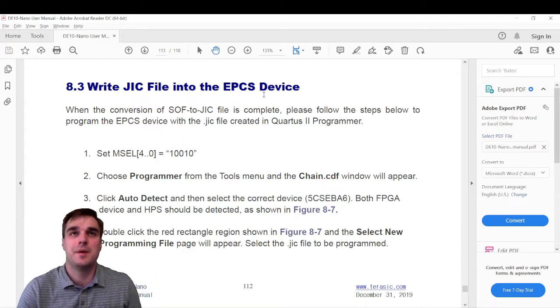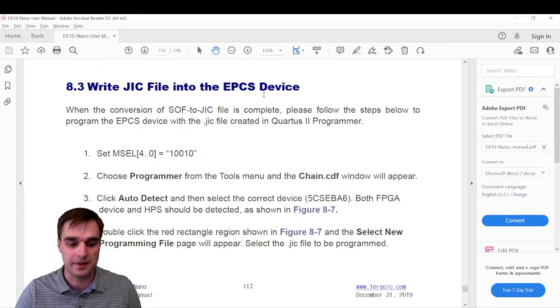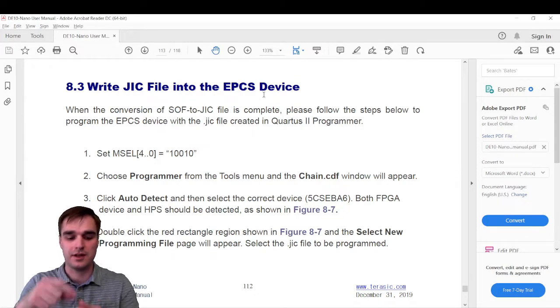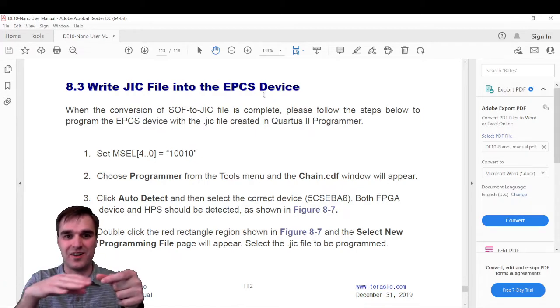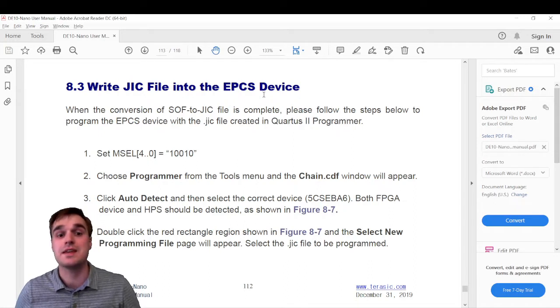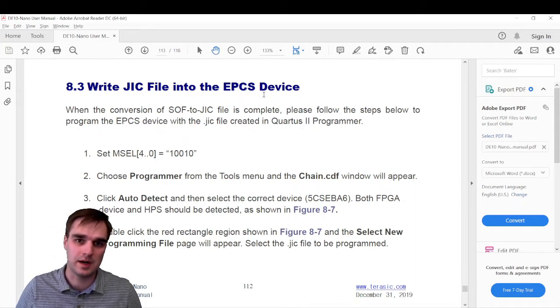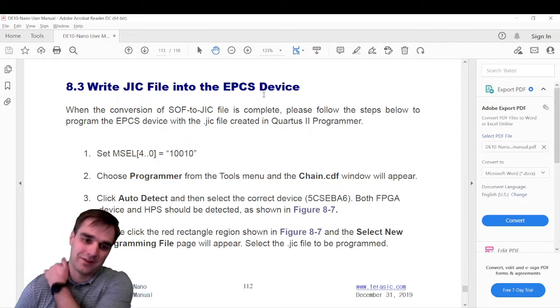And I believe from one of my professors, he was like, yeah, we had an EPROM. And what you had to do is peel back the top of it and expose the inside of this small ASIC chip and then put it out in the sunlight. And then the sun erased all of the memory and put it all back to zeros. And then you put the lid back on, and then you can program it and erase it and then program it. And then they came out with EEPROM, which is electrically erasable programmable read-only memory. And that was where you can electronically erase it. You didn't have to hold it out in the sunlight and wait some time. Anyways, just a little random tidbit.